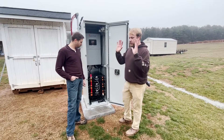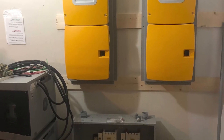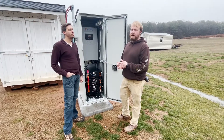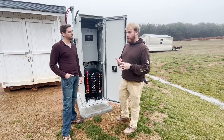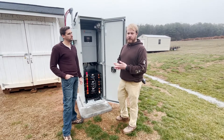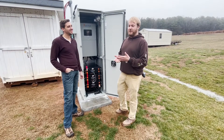By the time I put those inverters on the wall and the batteries on the floor and started looking at all the code compliance that I would need to meet, it became something that wasn't cost-effective or feasible anymore. When you have batteries in your garage, you've got to watch out for vehicles potentially damaging them. Any kind of damage to that battery could cause you serious thermal events.